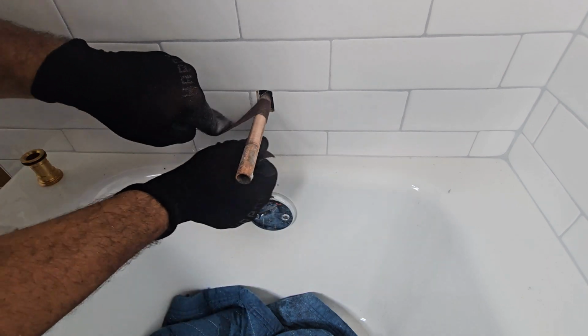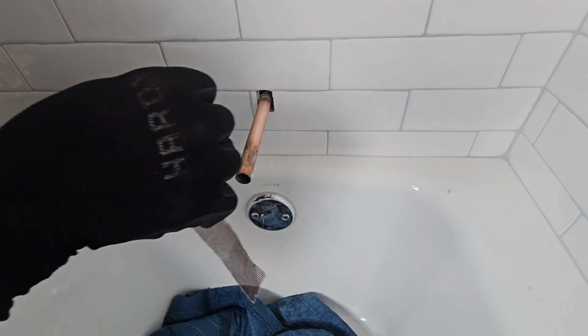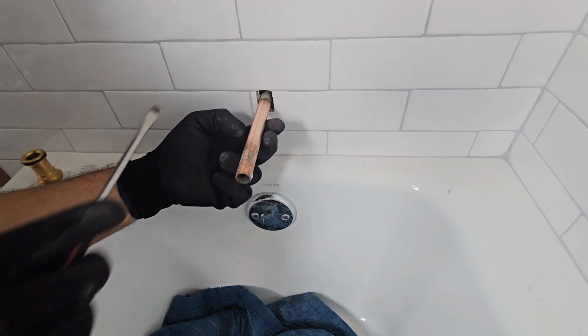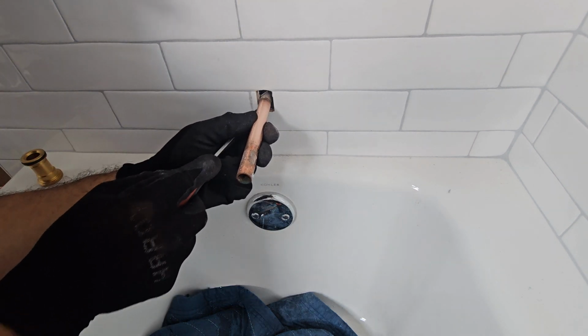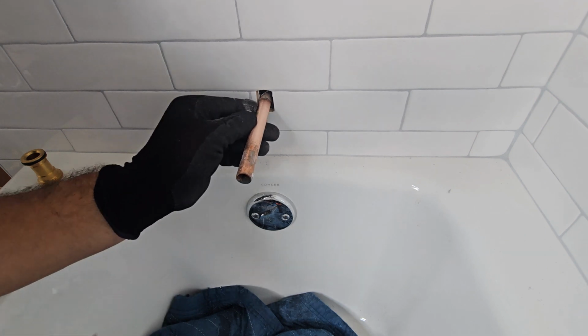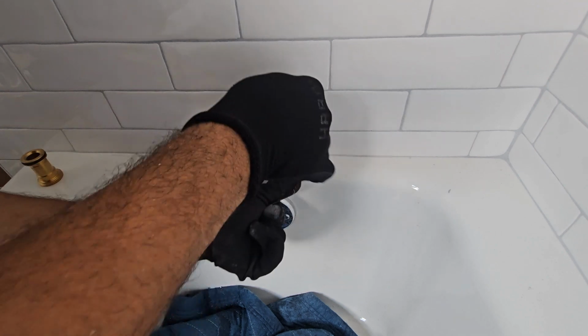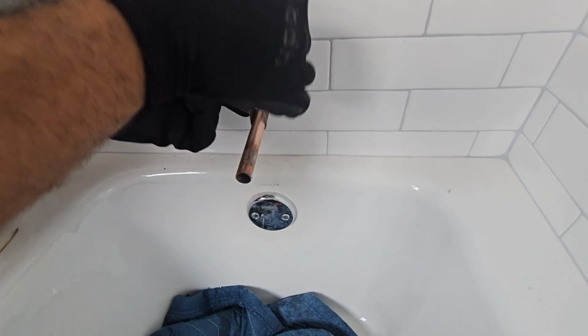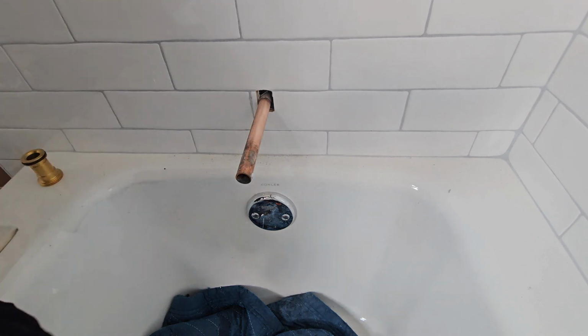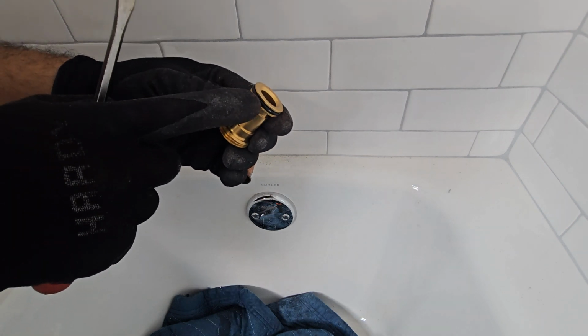That's all done. Now we're going to move on to the spout. A lot of guys install it differently. This is the way I install it. I stub out with copper. Obviously, I clean it nice and clean. Make sure you take out all the mortar or the thin set, grout, paint, whatever fell on it, because you know those contractors are never taking care of our pipes. So clean it real good, make sure it's nice and clean.